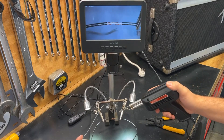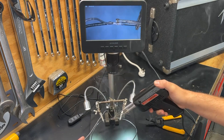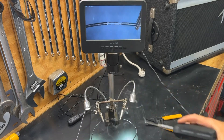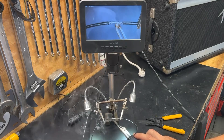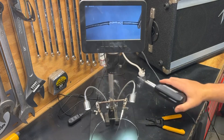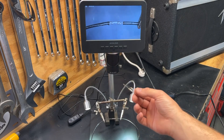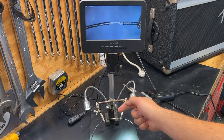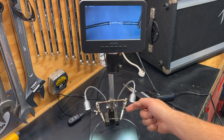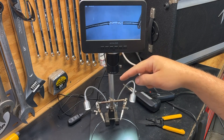Now, once we have everything set up here, we're going to let our iron heat up. You can see there — tin the tip of the iron. We're going to put a little bit on the top of the joint. Now, that's not complete. We want to heat up the bottom side and suck that solder all the way through those strands. And check that out — that's quite literally it. There are some cases where you're going to struggle with it more than that. But this is an absolutely perfect, impervious electrical joint. It's not as good as just a solid piece of wire going across here, but for repairs and connections, Bob's your uncle — this is the best you're ever going to get. Let's go ahead and finish this thing up.